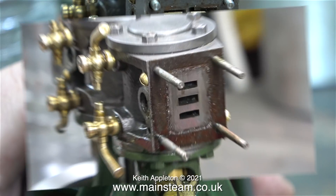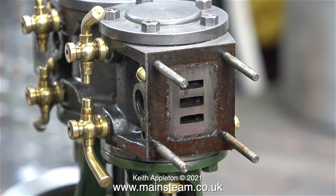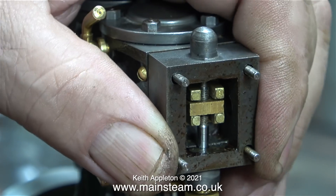When it was fitted in the original position it was impossible to get the timing anywhere near right - it was very retarded at each end of the stroke. But because I've put the valve in the other way round, it's now quite the opposite: the slide valve, instead of admitting the steam or air late, is now admitting it a little bit early. So this is no good either - I need to actually machine the valve to the correct length.